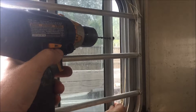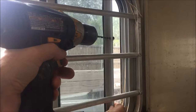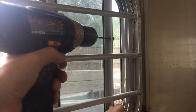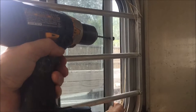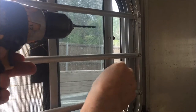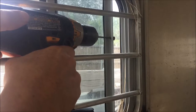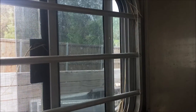You can see that the catch is held on by a small rivet, and all we need to do is drill it out. What we're going to do is drill the swaged-over part of the rivet off. There we go — we drilled it through. Now the latch is removed and the rivet is drilled out.